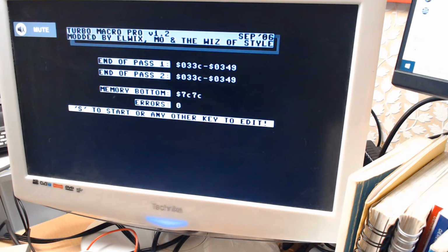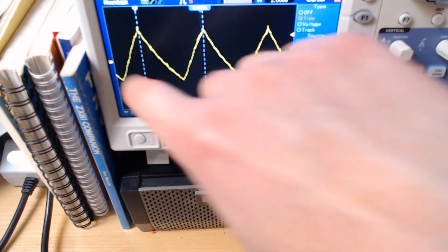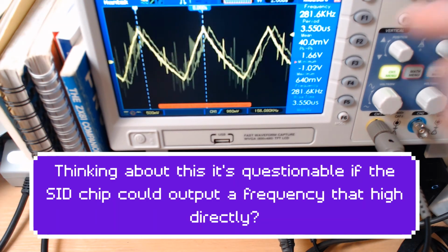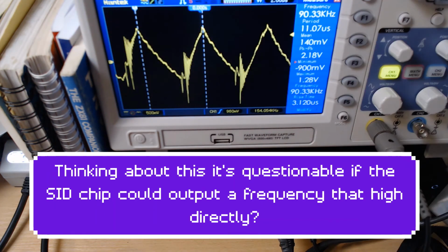Okay, just carrying on with this, what I've shown is what I think is the maximum speed that loop can run at, and I'm now considering that the 90.4 kilohertz was the correct frequency. When you looked at the scope, it's still running now, you're getting so many other artifacts in there that we had to do a manual measurement on a single sequence, peak to peak, with it triggered correctly, and that's where you get 90.4 kilohertz. Without the manual measurement, you're getting all those other frequency components. That's where the 281 measurement comes from. So it is actually varying between 90 and jumping all over the place. But in that position there, you can see, I think maybe because I've set this up, it's triggering better at the moment.